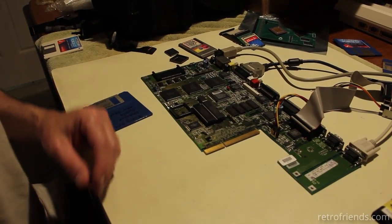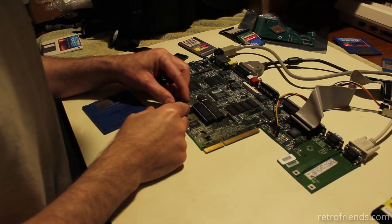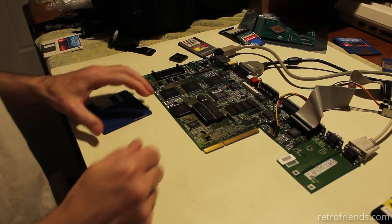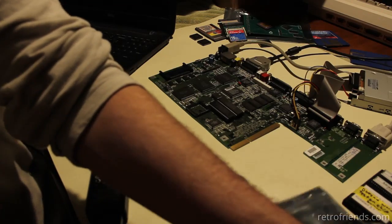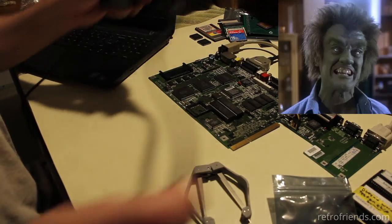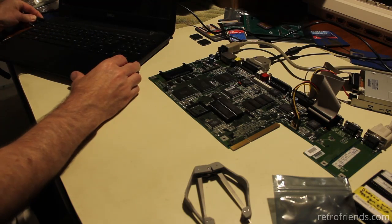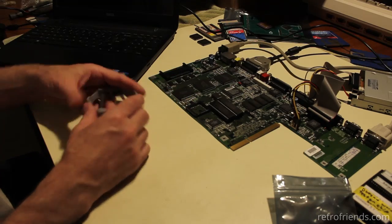And now we are going to put our floating point unit in. Just a quick power up, make sure we're still stable. That's not good. All right, so we got a yellow screen. Typical. So we're just going to use Amiga PCB Explorer to test all our pins on the socket and make sure we have a good connection.